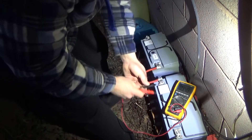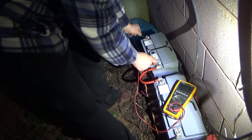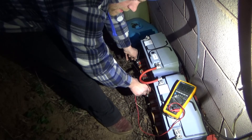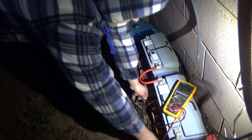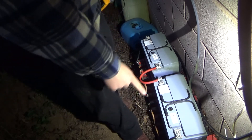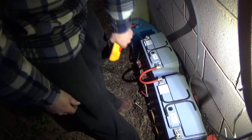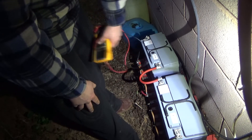Let's check the balance of the packs again. These new ones have probably come up a bit — reading 12.92 and 12.43. The existing pack is reading 13.44 and 12.439. So what I've actually got is the bottom pack is imbalanced. At some point I'm going to have to separate those packs out and get them balanced up — or there might be a balancer available for lead acid. Something I need to pay attention to: one pack's balanced and one pack's not.